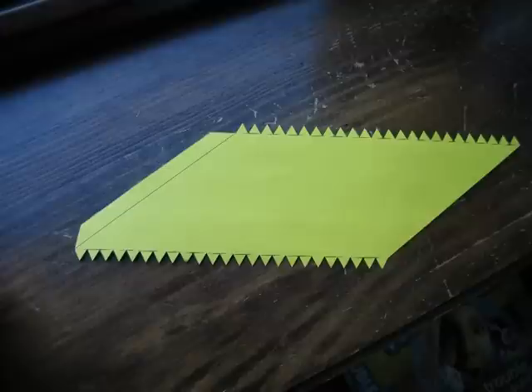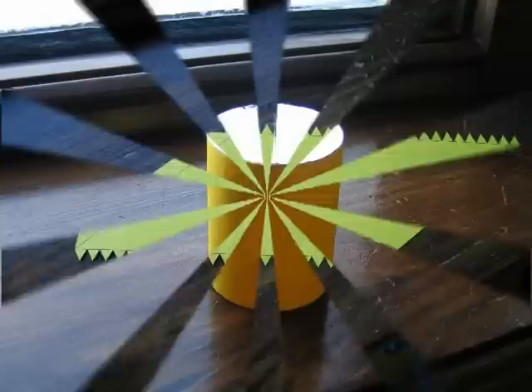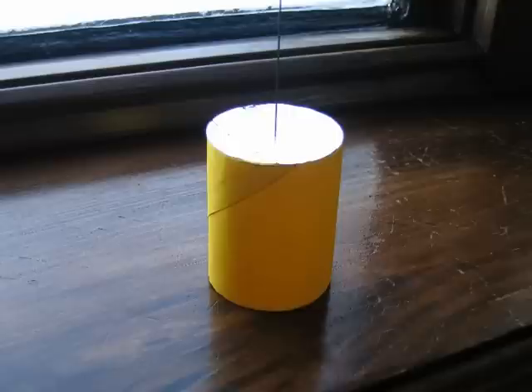I took a simple approach to the displacer and made it out of yellow paper and white glue. Believe it or not, paper holds up really well, keeping in mind the temperature inside the displacer chamber should never be anywhere near the surface temperature the fan sits on. Unfortunately the aluminum tape I put on the top and bottom to reflect the radiated heat away doesn't seem quite as resilient, but is staying in place for now.